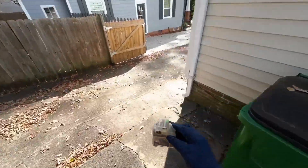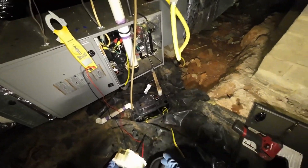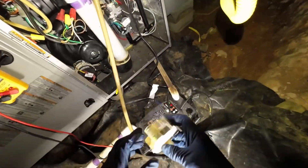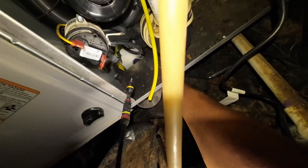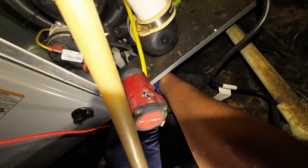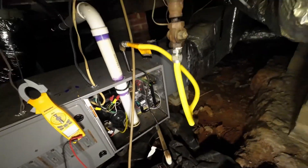There she goes. Let's go ahead and get down here and put it back together. Slide this in — make sure all the edges are clean so that it creates a good seal. Grab your screw and driver and get this thing mounted up. Make sure you don't cross-thread it — it's a brass fitting in there, so just snug enough; don't go crazy. That housing is nothing but cheap plastic. Throw the hose on there and let's fire it up.